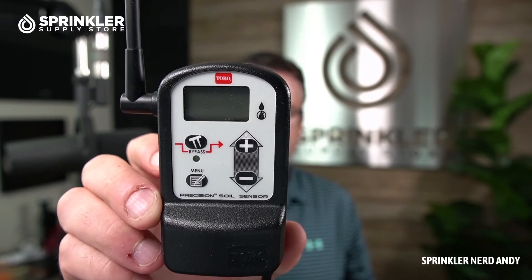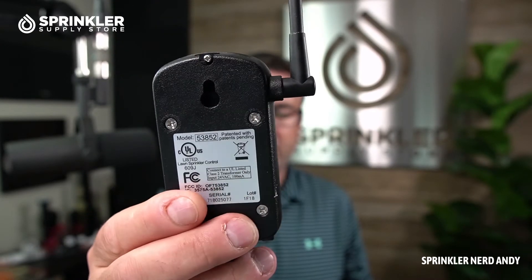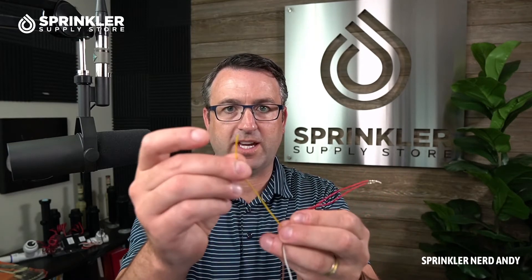Here's a close-up of the receiver module. There is a bypass button so you can bypass the sensor at any time, and there are more moisture and less moisture controls. On the back you have the hanging through-hole for your screw, and underneath is the second one. Wiring is exactly the same as a rain sensor: two red wires go to the 24-volt power side. You won't use the yellow wire — that's for older controllers. You'll use the brown and white wires on the sensor terminal inside your controller. If you have a wireless rain sensor, wire them to the very same terminal so your system can be off due to rainfall or due to enough moisture in the soil.